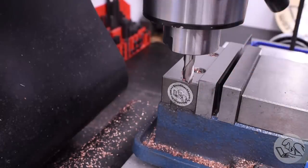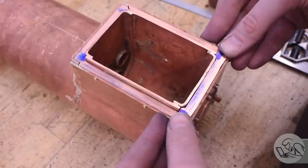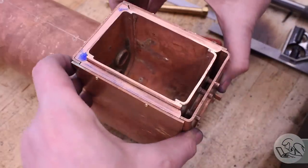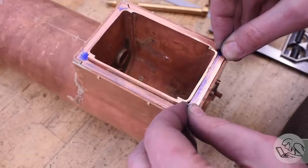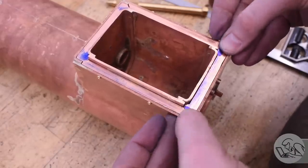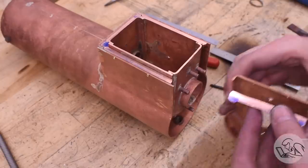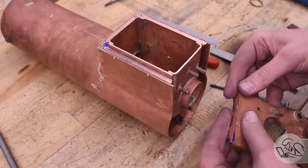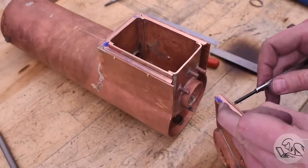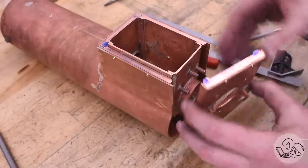Fitting the final piece now on the back head, getting very close. While you're doing all this filing and fitting, pieces will fall into the bottom of the boiler — you spend a fair bit of time fishing them out using forceps and picks and such to try again. This is looking really good though — I think I'm pretty much there on this foundation ring. The back head piece is actually very easy because it gets fixtured and silver soldered to the back head independently. This order of operations is supplied by Kozo in the book, and I'm sure he's got very good reasons for doing it this specific way. It does seem to work very well and I had no issues.